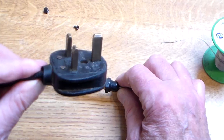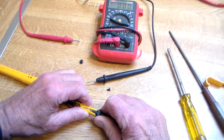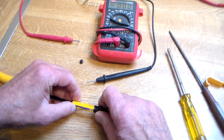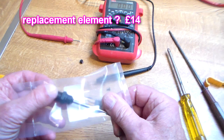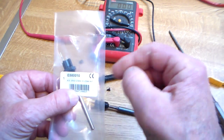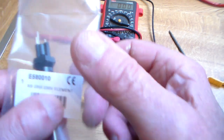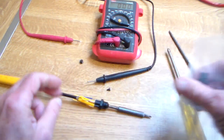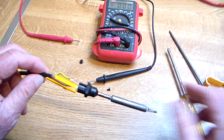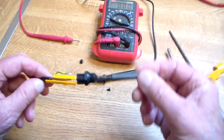What's the next step? Unplug the soldering iron again. Don't forget, you could spend 25 or 26 pounds buying a new one, or if it's an Antex or some decent make, you can get elements for it for only about 13 or 14 pounds, which is what I've got here. I'll put the part numbers down below — it's a 25 watt, 230 volt element, and as you can see, three pins. So what's the next step? You've got to desolder these and solder on a new one, which is a bit tricky when your soldering iron isn't working.